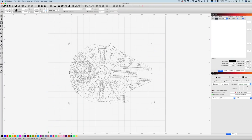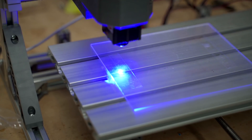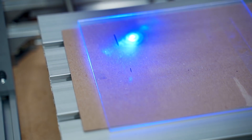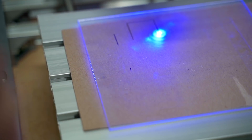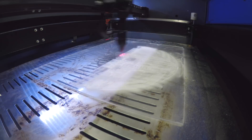I have used Lightburn, which is a great piece of software — there's a 30-day free trial if you want to check it out. I use it with my bigger laser, and you can do a normal laser cut where the laser starts and moves across, controlling both power and speed. I gave clear acrylic a shot and it didn't do anything to the surface. After some research, basically you can't engrave clear acrylic with a diode laser — I was actually burning through to the paper underneath, going straight through the clear acrylic. What you can do is get black acrylic, which absorbs the energy and either engraves or eventually cuts out with enough passes.